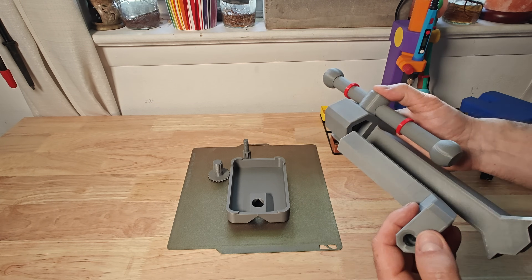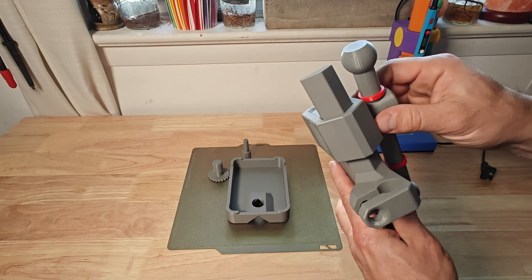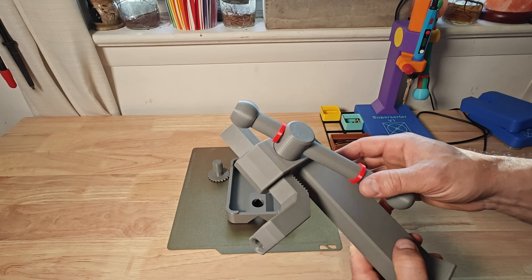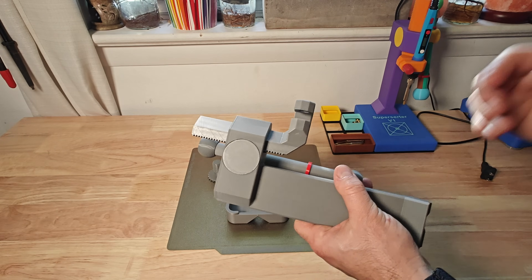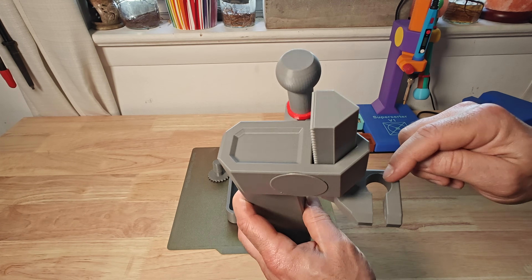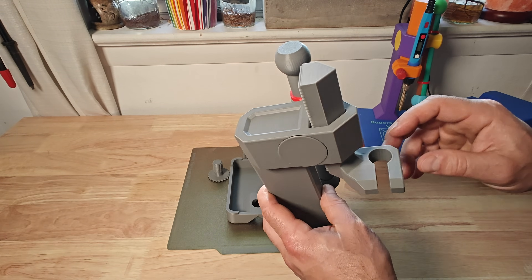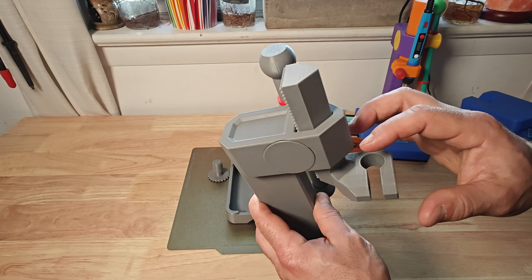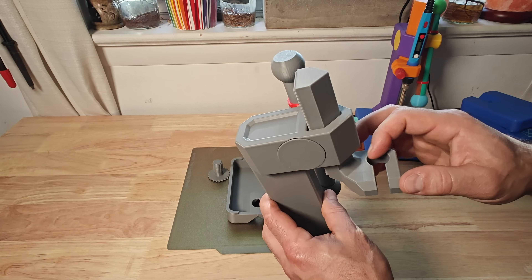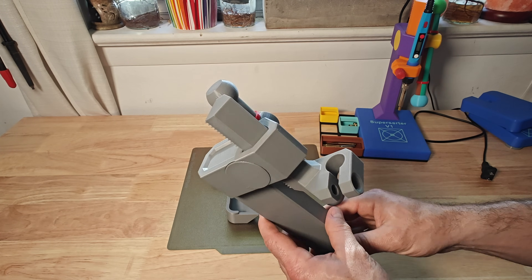Slide the handle through the gear piece, install the second TPU handle stop, and then finally the other handle end cap. At this point take the RAM and install it from the bottom, rotating the gear piece to pull it up. Once the RAM is installed, the shape of all of these components keeps them fixed and rigid in place, so no extra hardware is necessary. This RAM piece comes in two options: a small bore size which fits the $10 soldering iron linked in the description, and there are also two shims for this size in case you're using a thinner soldering iron. There's also an optional RAM with a larger bore for a larger soldering iron, and the larger bore has three optional TPU shims to size it down — hopefully between all of that it covers most soldering irons.